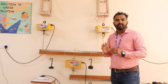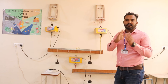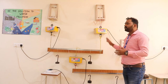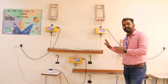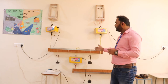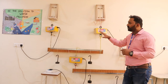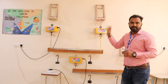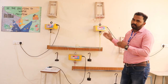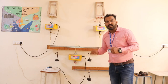There is no graphical method for a compound beam; we will solve it only with the analytical method. You already have the observation table and write-up in soft copy — go through it. You have to repeat this procedure for all five sets of readings, changing W1, W2, W3, W4 and L1, L2, L3, L4 each time. For all five readings, measure reactions at A, B, and C. The percentage error for all five readings should be less than 5%. Thank you.